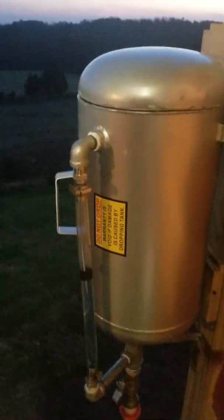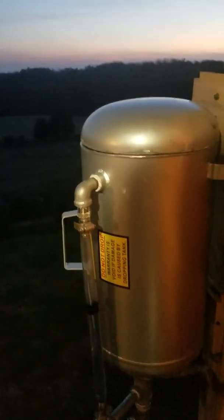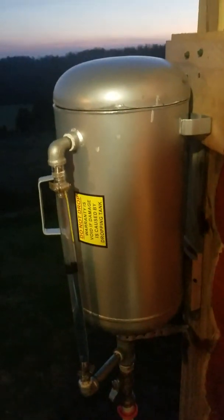You see it's not full — if it's seven gallons and I've got three in it, that means it's got four gallons that it can expand into. If for some reason the stove did overheat and needed to get rid of pressure, it can just fill that tank up as the pressure bubbles through the glycol and release the pressure without losing all my glycol.